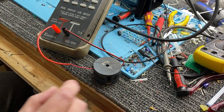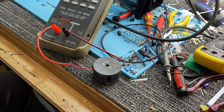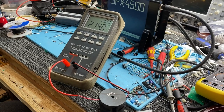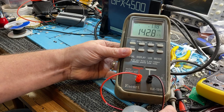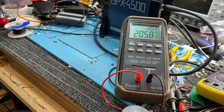We've got this thing together at the moment, so it's a nice little enclosed unit. Let's turn it on and just look at the inductance — we're measuring it at a kilohertz, which is somewhere where we want to be operating. At the moment it's 205.7 microhenries. That's way too low.